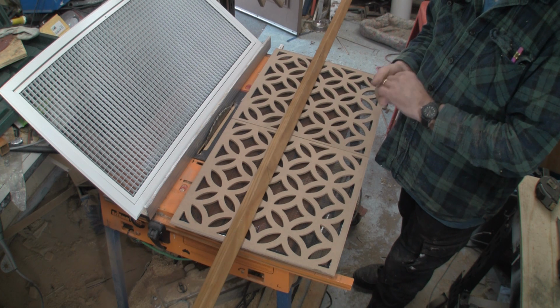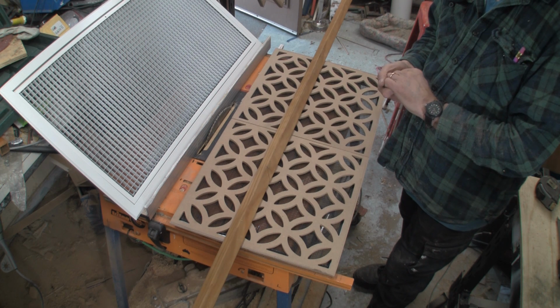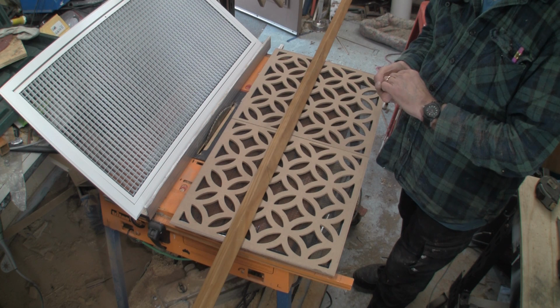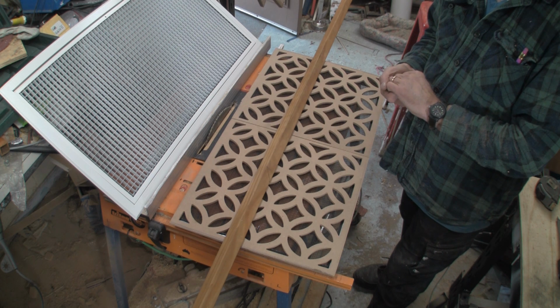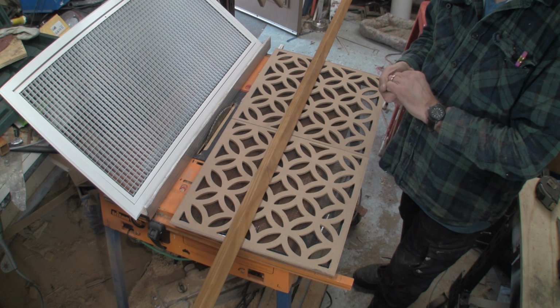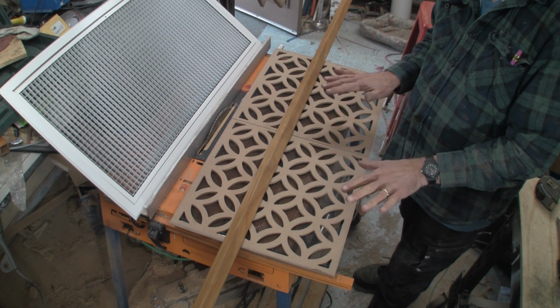Unfortunately though, the issue I have with that is it is way thicker than what our actual floor is, and our floor, from what we can see, has never been sanded before. It's still in its original condition, which amazed the floor sander who came through and sanded all the floors and clear finished it for us. So consequently, I've got to try and drop this piece of wood a little bit lower to match up with the rest of the floors.